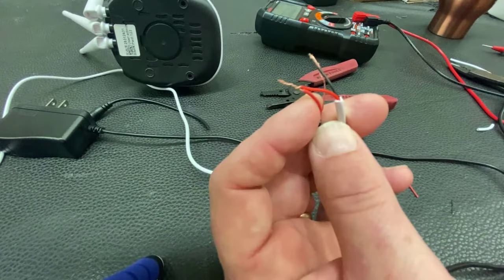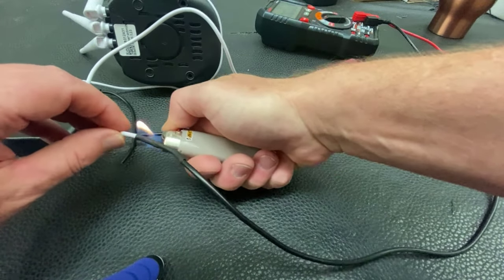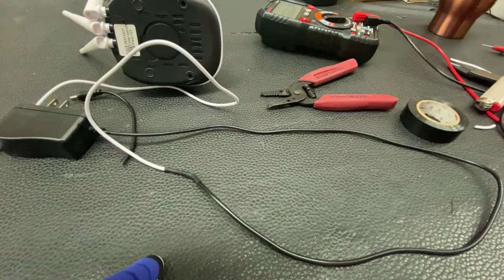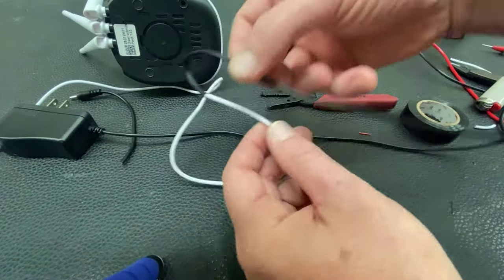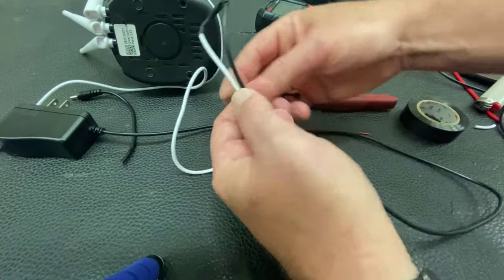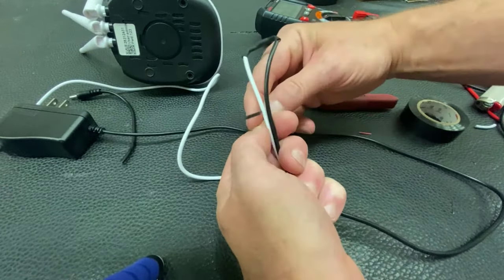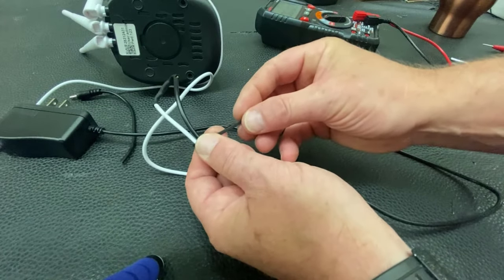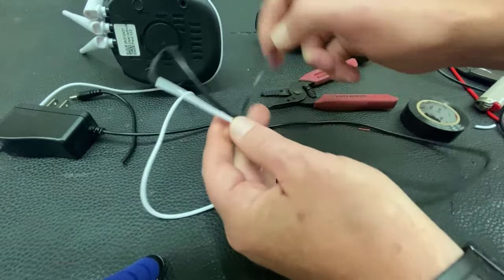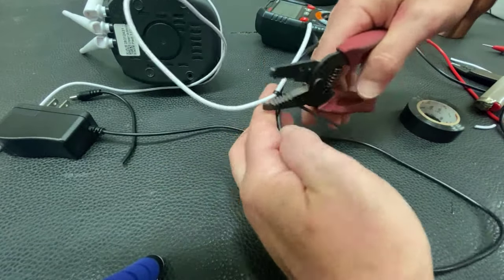As an aside, if you're going to have any possibility of stress on your wiring, I would definitely suggest making a loop like this. Take a wire tie — they work really well for this job. It takes the pressure off so that in case there's ever a pull on the wire, it puts the stress on the tie rather than the wire connection, which is really good practice.